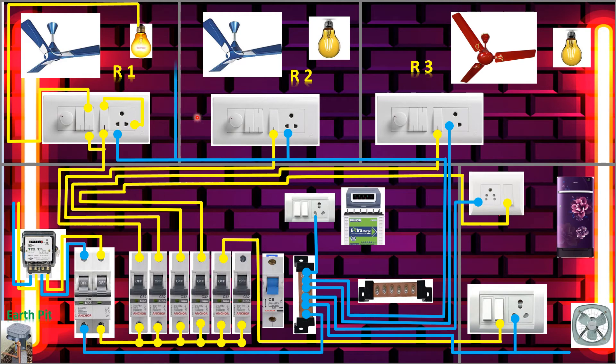One room phase connection is completed — only the inverter wiring is remaining, we will do that later. Now we'll start the second room. We give the supply to the switch and give the supply to this circuit from this switch. Now we'll connect the phase to the bulb — it is going here — and this is done.